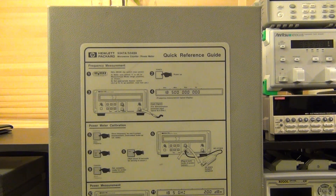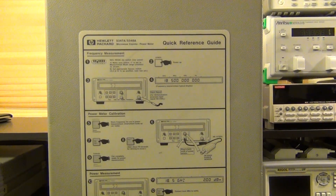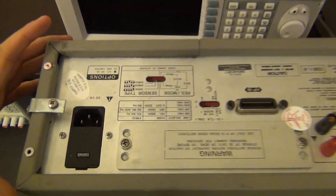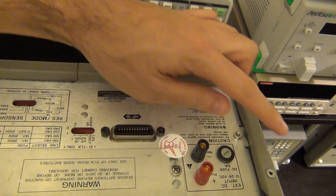Now that we understand exactly how this instrument works, let's take it apart and find out what's wrong with it. Again, to remind you, the 20 GHz input is not working. Here I have the unit set on its front, and you can see there is a quick reference manual on top, which can be very handy. I was going to take it apart and noticed this thing has seen better days. The only thing actually holding the cover together is this little bracket that someone has installed — this is not something HP has done. Some of these screws are even loose and don't really do anything.